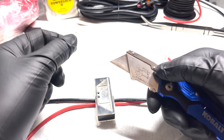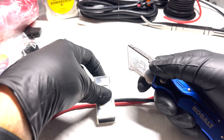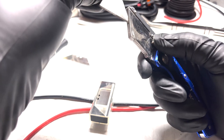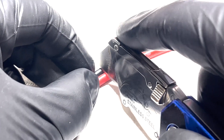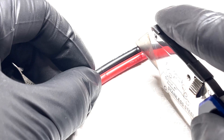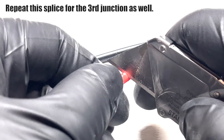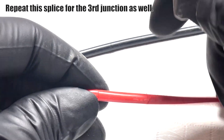It's also good practice to put a fresh blade in because you don't want to be sawing into it — you shouldn't have to. Just get a fresh one out of your reserve and slide it right in. I'm going to put a little slice here to mark where I'm going to be cutting on both wires, about an inch down the line. The reason I love these silicone wires is because they're just so easy to cut — they're like butter — and it makes wiring so much easier.